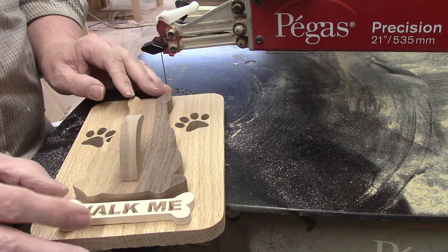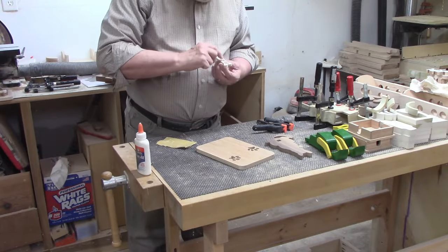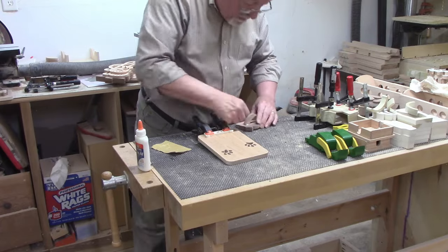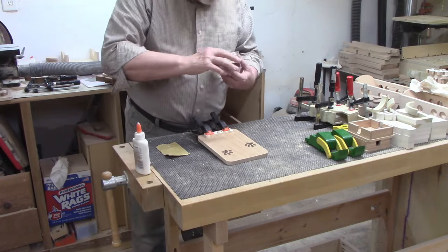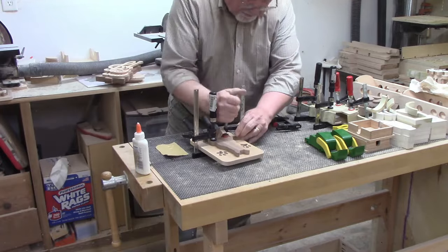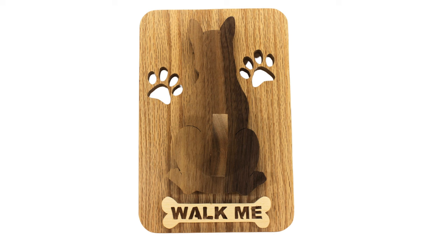This did not take long to cut and it's looking good — all that's left to do is the glue-up and the finish. I started the glue-up with the bone, using a small bottle to squeeze out a bead of glue, then spread it with my fingertip. I used two spring clamps to hold the bone in place while the glue dries. Next, I added glue to the surfaces of the dog's tail that would contact the slot in the backer — it was a snug fit, so I had to work at it a bit. Once that was done, I squeezed some glue onto the back of the dog and spread it evenly, placing the dog between the paw prints on the sides and between the top of the backer and the bone on the bottom. I added F clamps to hold the dog in place against the backer while the glue dried. I like the way this project turned out — it almost makes me wish I had a dog. I'd love to read any comments you have on this project, and I reply to every comment. Please subscribe to the channel if you haven't already done so.